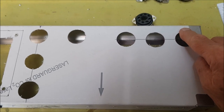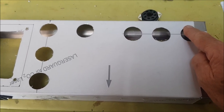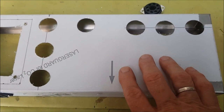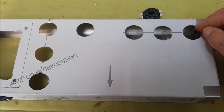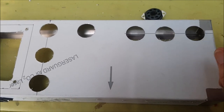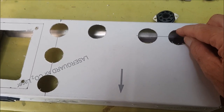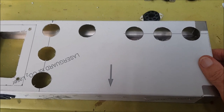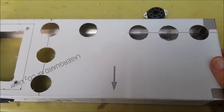And then the other thing to think about is, do I do the modern thing of the heater wires in twisted pairs, sort of up and over, or do I go old school, because this is, after all, a 1930s amplifier, which would be to ground one heater connection to the chassis at each socket, and then just have one live wire running from one socket to the next. So that might introduce a little bit more hum, but it's much simpler and neater. So I'll think about those things.